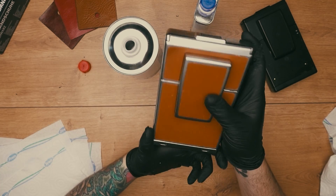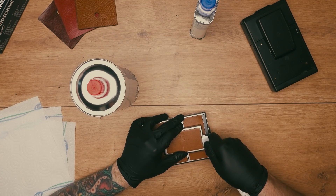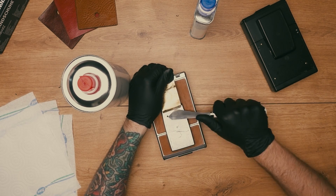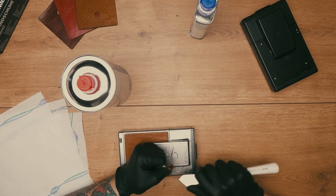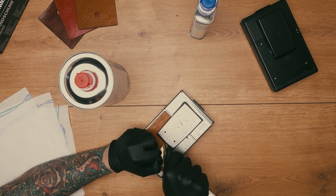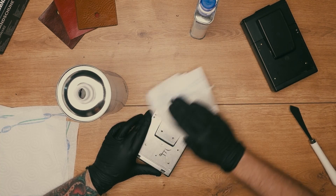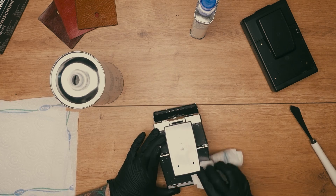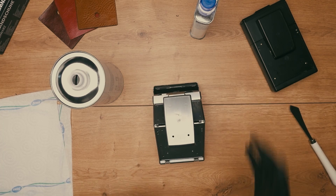We really have to watch out here so we don't put too much force on the lid that opens to get out the film — just cut it off at the end. There's still some glue on it, so we're going to take care of that later. First we've got to remove the leather on the top — we start at the viewfinder. Hold the viewfinder when you start because it's pretty wobbly and we don't want to break it. Just cut off the leather slowly using the same movement, always cutting through. Then when you have all the leather removed, take the solvent again and just wipe over all the camera until it's clean and everything is shiny. Now we have a clean camera with all remaining glue stains removed.